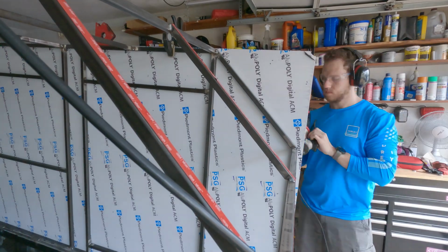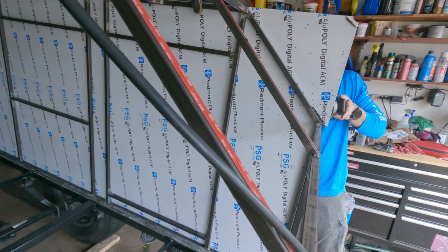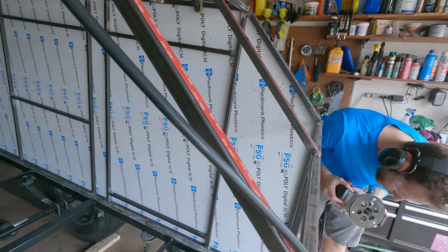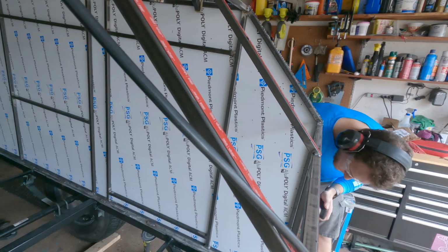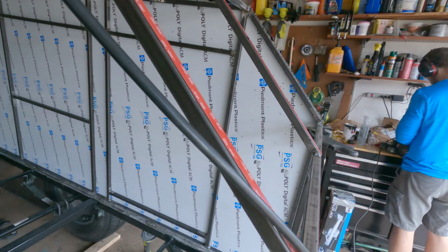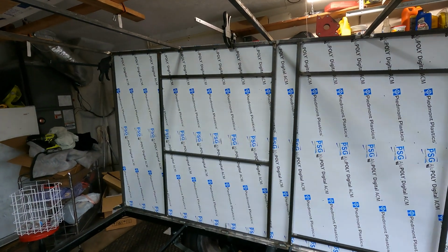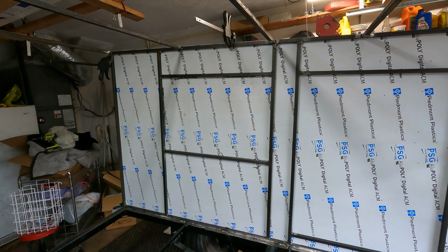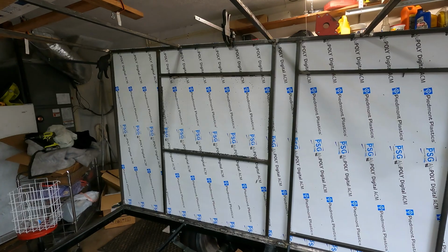For our wall panels, I threw it up on the trailer, clamped it down in place, and then used a router with a flush trim bit to get a perfect angle, and this worked out really well. This aluminum is very easy to cut, it just makes a big mess. Now for the window holes, I went on the backside, drilled some points on where the start of the curvature of my window was, and then used my frame again with the flush bit so that I have perfect lines. I just found it easier to use the template I already made.